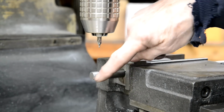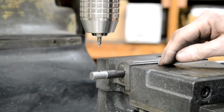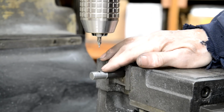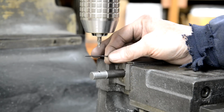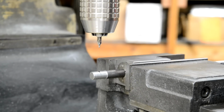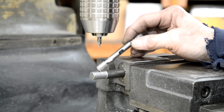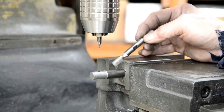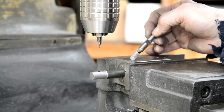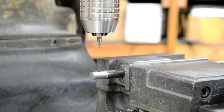I turned a piece of this down to the half inch I need, the right length, but I left the rod because I've been able to put it in a 9/16 collet in the collet block, so it just holds it nicely. So I've got to start and drill in, spot and drill. That will drill there. Then I've got a 76 thou drill, which I'm going to drill a hole through. Then we've got a quarter inch end mill, so we'll plunge in to make the counterbore for that nipple to fit into. Then when we've done all that, I can grip this in the other vise, turn it over, and do my slot into there. And then we'll just cut it off and face it, and it's done. So that's the plan. Let's see if it'll actually work.